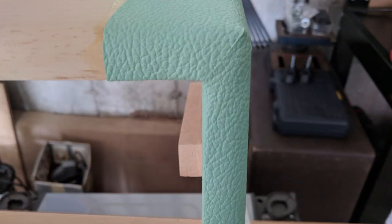So the big thing about tolexing is doing the corners properly. I looked at some of the amps that I had and saw how they did the corners. I also mocked it up with just a piece of loose leaf so I could understand the cuts I would have to make, the 45s I'd have to make to get those proper corners. And I think I did a pretty good job for the first time through building an amplifier. I'm going to put some pictures up here. Obviously, you might be seeing them now.